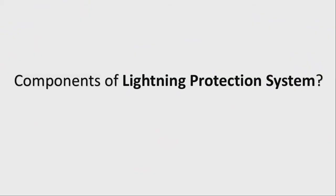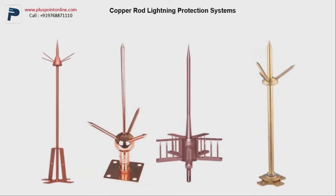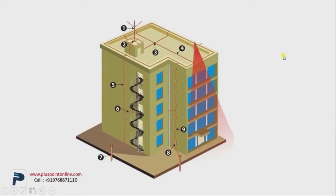Now let's get started with the components of the lightning protection system. The first one is the copper rod lightning protection system. In the copper rod, there are various components and each one has its own fundamentals. This is the rod made out of copper in which you can see the spikes attached. In buildings, these copper rods are installed in different areas and also the topmost part. These copper rods are combined with the copper plates, which are the copper strips that are attached to the ground. If there's any lightning strike, the copper strip helps the lightning go into the ground for grounding. This system is known as the copper rod system, but it has become quite outdated.